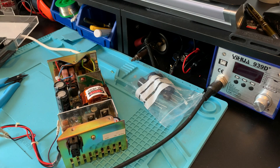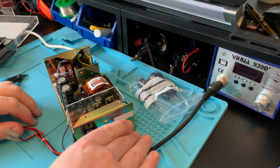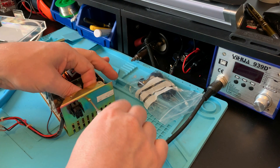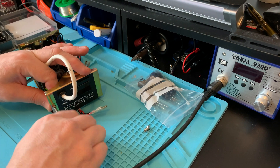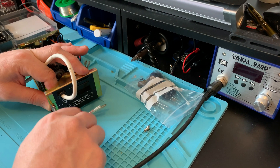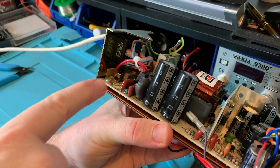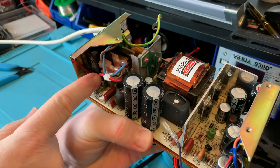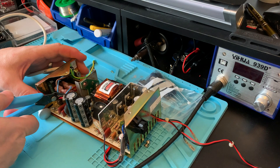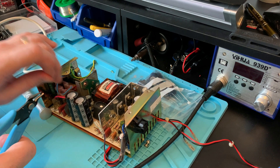While the keys are drying, we'll turn our attention to the power supply and the fitting of new capacitors. After undoing the screws holding the power supply assembly to its chassis, we need to take note of where all the wires connect to the switch so we can replace them properly when we're done. It will help to take a photo to refer to. Once you're happy you know where everything goes, we can clip the zip tie holding the wires together and start to unclip them.